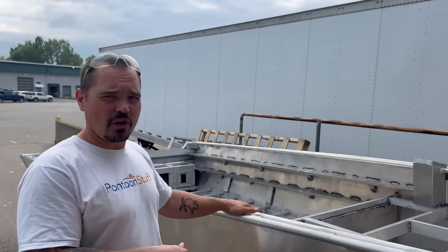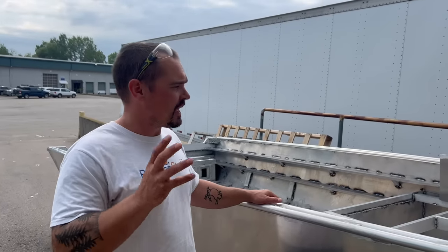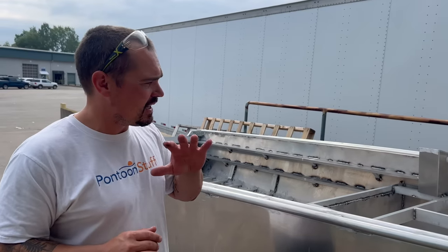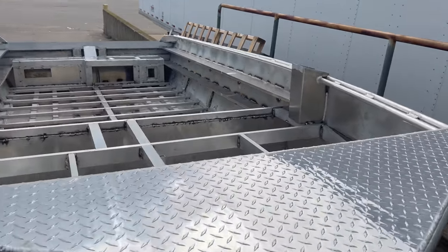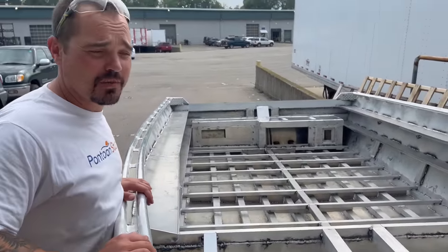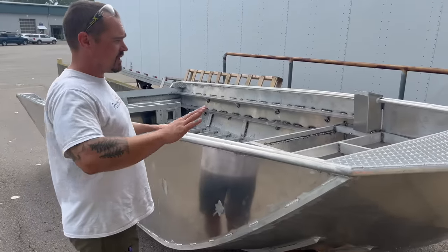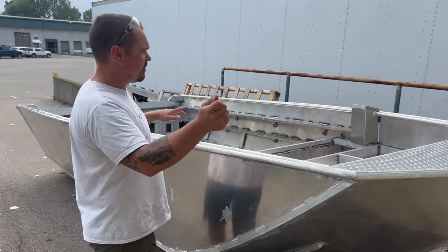We've got to scrub this thing down real quick just with dish soap and water, and then with a Scotch-Brite pad. And then as soon as we rinse that off, we're going to acid wash. So it's just muriatic acid. I found the instructions simply from Tough Coat's YouTube channel. They had some videos of just a Scotch-Brite pad with muriatic acid. Do a section, rinse it.